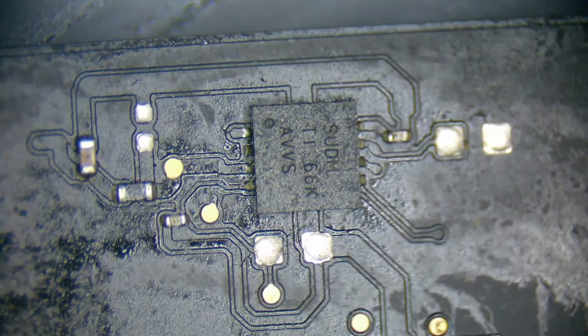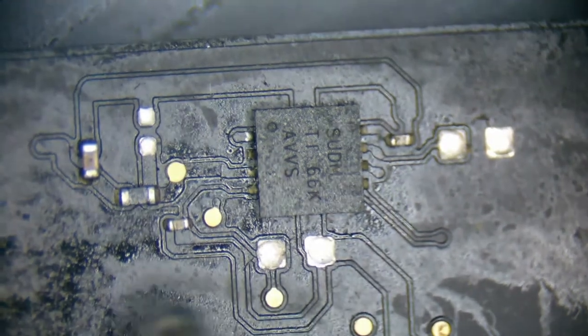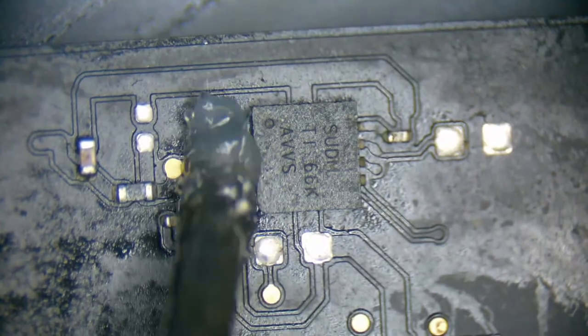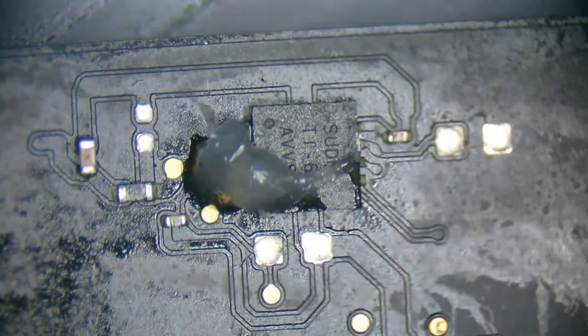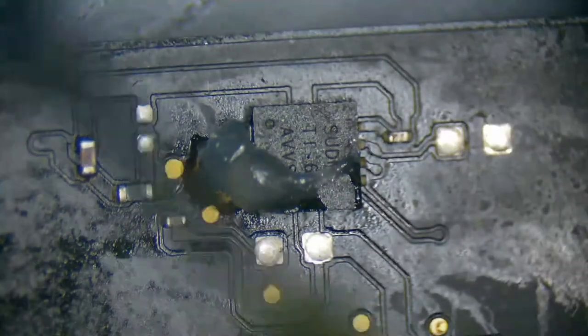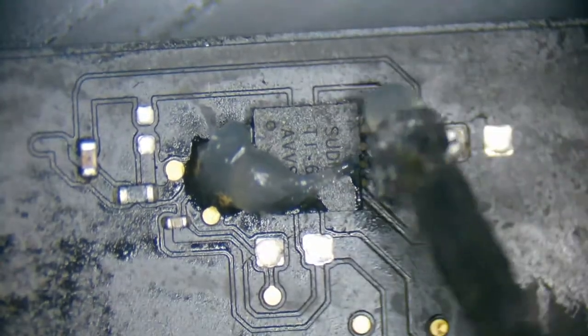Off the top of my head, I don't really have an answer of what that could be. Usually in my experience, that has just been something preventing the rest of the computer from turning on. I think I've actually had some with a shorted PP bus, although I'm pretty sure you've already ruled that one out by now.